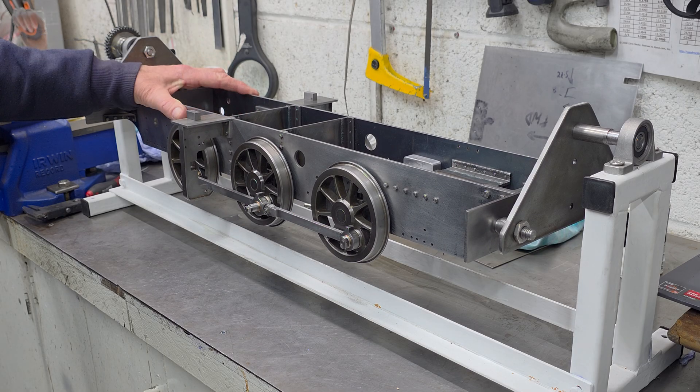The downside with the white vinegar or the brick cleaner approach is that it will leave a fine etch on the surface of the steel, which will make it very prone to rusting. Unless of course I painted it fairly quickly after taking the scale off, but I'm not ready to paint yet. There's a lot more work to be done, and if I paint now it will just get damaged. So I'm going to hold off on the mill scale removal for now.